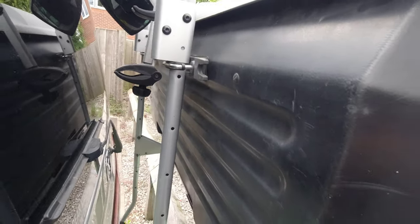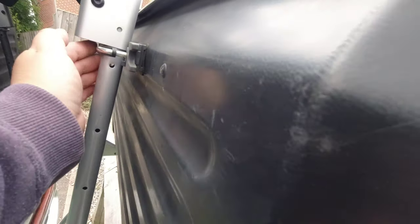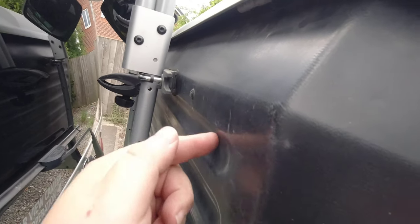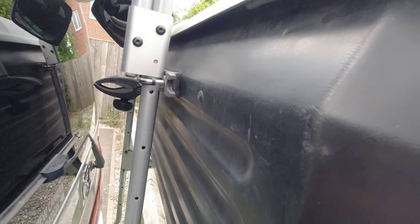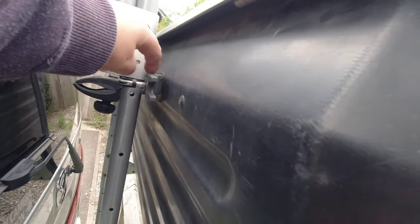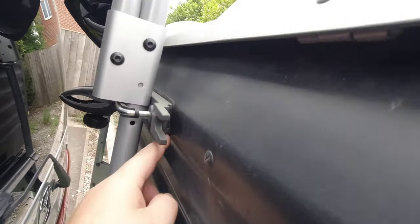The way it fits on the back is that U-shaped bracket with the plastic insert. I think those plastic inserts are meant for inside, however I've used them on the outside because the rubber, when you tighten it all together, gives you a weather seal so that any water coming down here doesn't go into the box — and as you can see, that's a really tight fit.